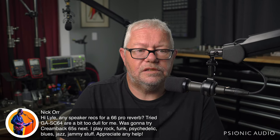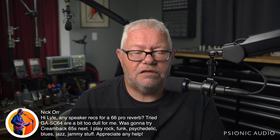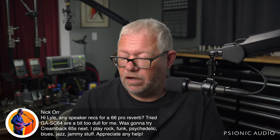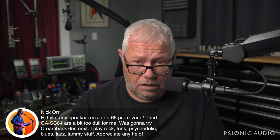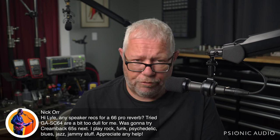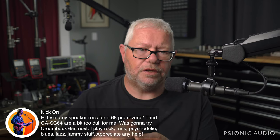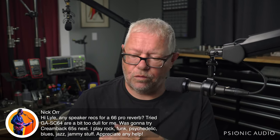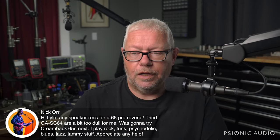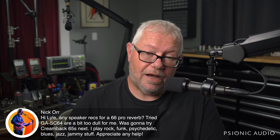Hey, Nick. Speaker recommendations for a 66 Pro Reverb. All right, if the SC64 is too dull for you, you'd probably find the Creamback 65s and the ET65s also a little on the less bright side. All three of those speakers, the Creamback 65, the ET65, and the Alessandro GA SC64, are designed to be full frequency response with lots of mids, lots of lows, and quite a bit of highs, but not glassy highs.